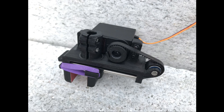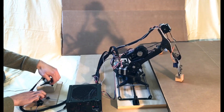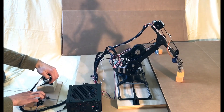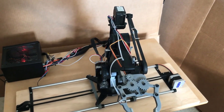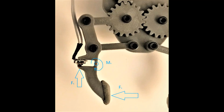The reason for the unconventional looking design is to avoid stalling the servo. Most servo grippers, like the one I designed for my last robot arm, operate by directly closing the gripper with the servo, which stalls the servo every time it grips an object. I tried to avoid this problem by detecting when the gripper had closed on an object, but this didn't solve the problem entirely.